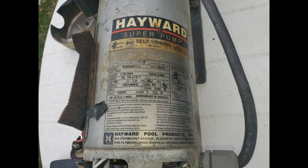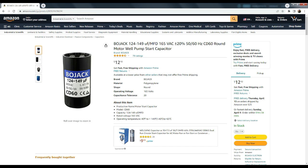At 115 volts it draws 19.4 amps, which is more than a 20-amp breaker can cover — that's why it runs on 240 volts at 9.7 amps, 60 hertz, single phase, thermally protected to 50 degrees Celsius, continuous duty, assembled in Mexico, but again pushing about 20 years old. I went on Amazon to look for some parts but wasn't really able to find much by model number.